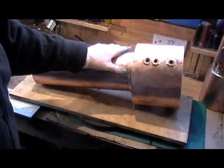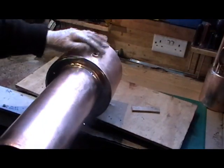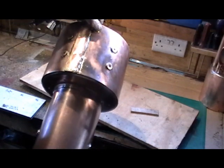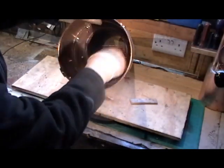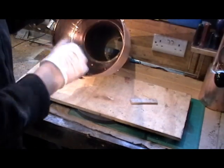It's now ready for the next — third — boiler inspection before I finally put it all together. I'll just show you around it: I've got all the bushes soldered in, the strap at the bottom that joins the outer firebox, the feet bushes, the blow down, and the clack valves. It's all done now and I've cleaned it up ready for inspection so they can see everything, because it's important they see that you've got full penetration of silver soldering on all components.